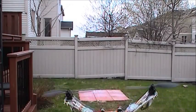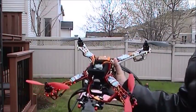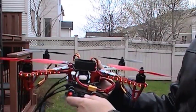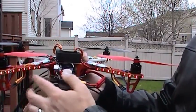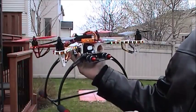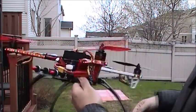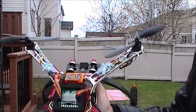Hello, welcome to my first flying video. I have completed the drone as you saw in my previous videos. Red for the back, white for the front — you can see the LEDs. The way to install LEDs correctly is to put more red in the back and more white in the front, so that when you are far away you can see if the craft is facing you because you see more white, or going away because you see more red.